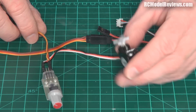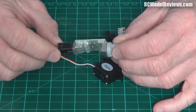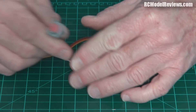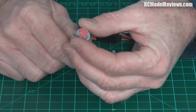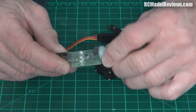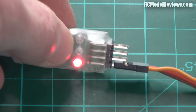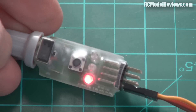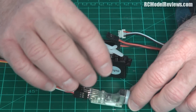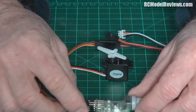Let's see if we can make it fault. I've got one of these little servo testers - these are really useful things. This is one that Flydream sent me some time ago and I've made a lot of use of it. It's got a little knob you can turn to adjust the servo position; you can even use it for testing speed controllers because this becomes your throttle control. When you turn this the servo arm should turn. It has a button which cycles between three modes: manual mode where turning the knob turns the servo, and center mode where when you're setting up a model and want to get the servo centered, you press a button, the servo centers, put your arm on and set your linkages up.